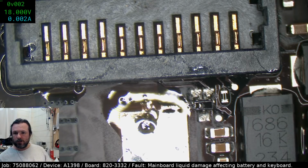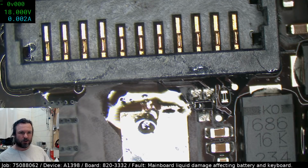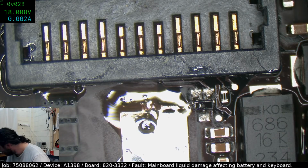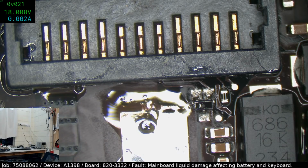Well, what I'll do is I will have a look at the schematic board view, see what the values are, and just see if I've got them in my stock. C69, 1 microfarad, 25 volts, 603. Oh yeah, I've got to have those. 603s.